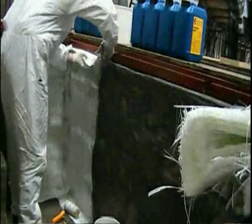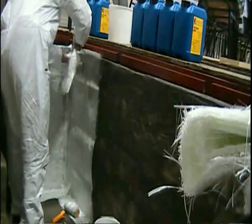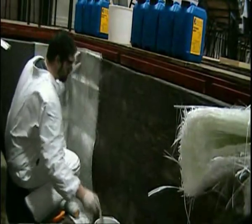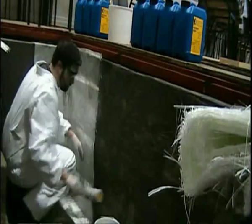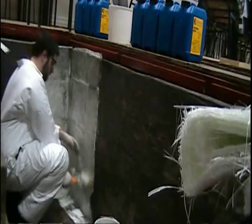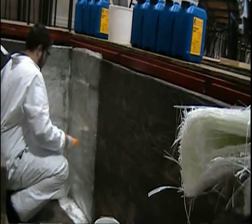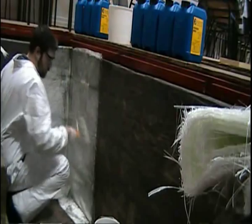It's a good idea to invest in a good quality pair of shears — this will make work a lot easier when cutting through the fibreglass. Continue by applying more resin to the fibreglass matting. Make sure that the fibreglass mat is thoroughly covered with the polyester resin and there are no dry areas. Also make sure that the laminate is not over-saturated, as this can break down the fibres of the fibreglass matting and cause weak areas in the structure.